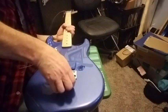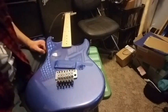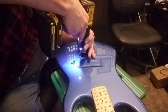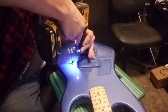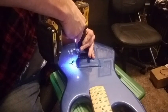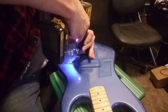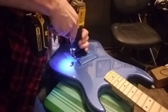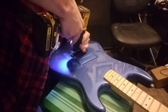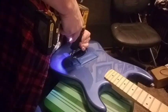I've got it on with one spring in just to hold it, and it needs a little bit of string tension to seat it the way it's supposed to be. Now I'm taking a tool - I'm not quite sure what it's called - but it eats the wood away very quickly. What I'm doing is eating away the side so that when I put the trem arm assembly back in, it won't be rubbing on the side of the body. That was a little nerve-wracking but it ended up working out. I would work it for a while, try it, see if it still moved or not, then keep taking a little bit more.